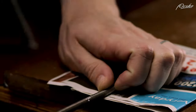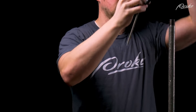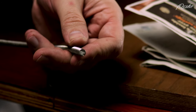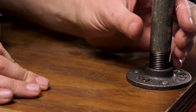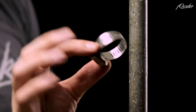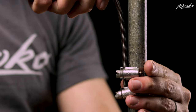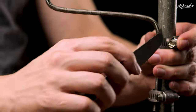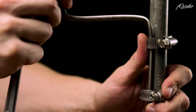If we place the edge of the pipe at that weak area, you should be able to bend and break it. Now that we have the threaded rod bent into shape, you can twist the one-half inch pipe onto the metal floor flange, securing it to the baseboard. Then slide the hose clamps onto the metal pipe and slide the threaded rod inside the two hose clamps. Make sure that they're spaced far enough apart. We can then use the screwdriver to tighten the hose clamps and lock the threaded rod in place.